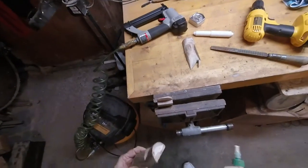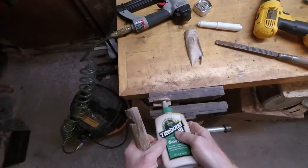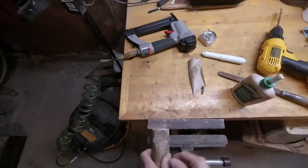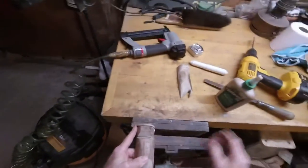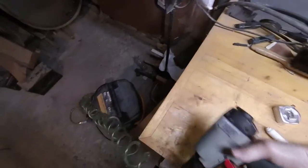Alright, so I've got it sanded down. I'm just going to put it together using a couple of 18-gauge brads about one inch long — all it has to do is hold it. You'll notice it's still a little proud along the edge, and what I'll do with that after it's all done is take the rasp and bring it back down.